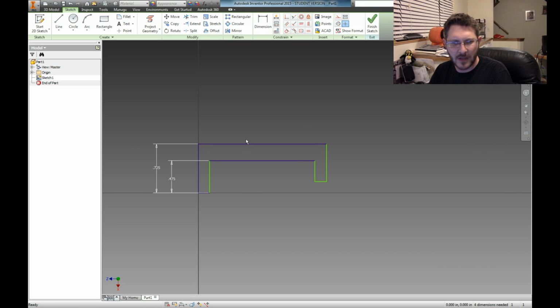I don't know, 1/4 of an inch seems like a lot, doesn't it? I mean, I'm literally just off the cuff doing this. Let's do 1/8 of an inch instead. That just looks a little thick right in this region right here. So let's take and go 0.725 minus 0.125. Well, heck, I could have done that in my head. That's going to be 0.6. Yeah, that's probably better.